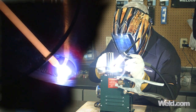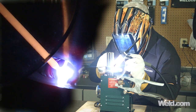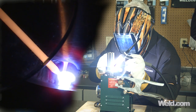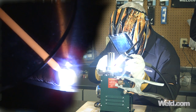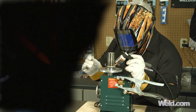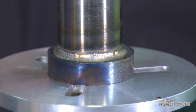I'm running a 1/16th tungsten, pointed. This is DC. Just a dab, dab, dab — I've got a tack that I'm getting ready to absorb, and I think I did. I think I've gone a full 360 and I've overlapped. I just taper off real slow, and then everything re-solidifies. I hold the torch there for a little bit. Post-flow is about 10 seconds. And the weld is finished.